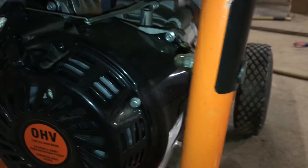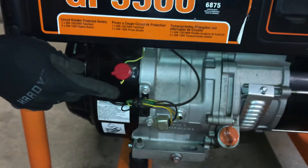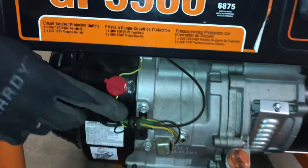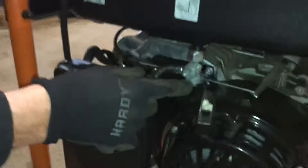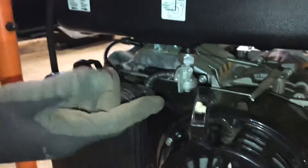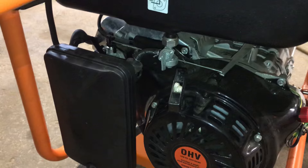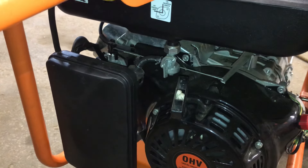We got to come around to the other side of the engine for the on/off switch. This one is right on the side of the recoil housing — make sure it's on. So we check the oil, we got the button, we're going to switch on, the choke is now in the on position, and the fuel shut off is on right now. Should be one or two pulls and it should fire right up if your generator is operating correctly. It all depends on temperature also — if it's really cold outside it may take a couple more pulls, but we're inside right now so it should only take one or two pulls.